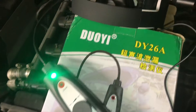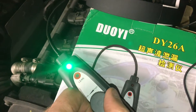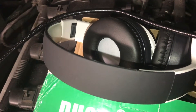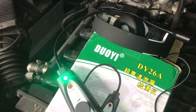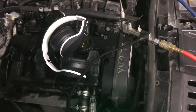This ultrasonic detector has a high sensitivity and a low sensitivity. When you turn this knob, you're going to hear a tick. When it's on low sensitivity, it's going to tick slower. When it's on high sensitivity, it's going to tick a lot faster. So you want to keep the wand nice and still and then listen to the rhythm. Now I'll let you listen to the air hose and see how we tested it — I'll let you hear it.